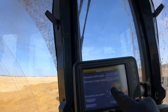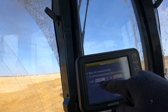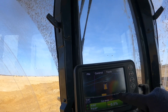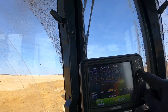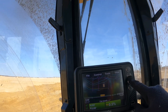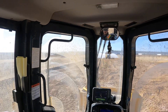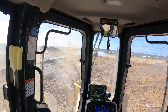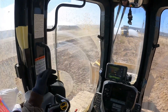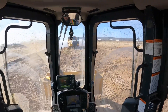This is where your elevation is set. And then to change the controls — the elevation point on the blade — you just go to blade control. So that's the model, right? You're zooming out, zooming in. And all the purple lines there, those are the different surfaces. And since our subgrade is at negative 0.50, negative 0.92 — it would be negative 1 actually — that would give us the 6 inches. So we're working our way down to the 6 inches, working this subgrade.